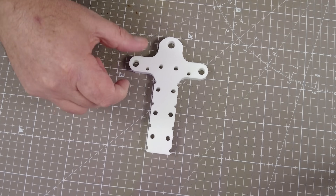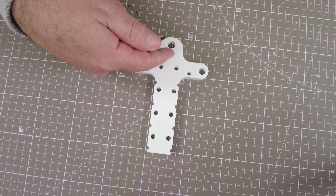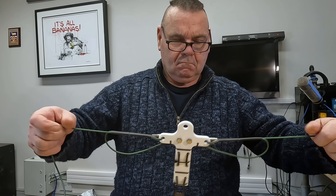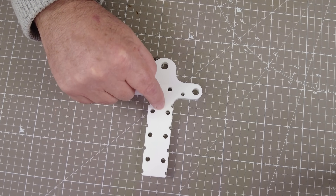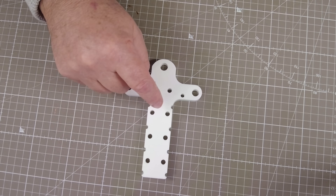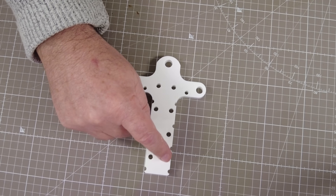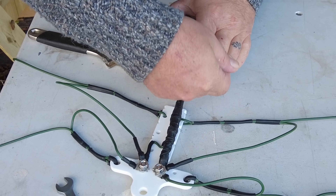It really doesn't matter how you build it — people copy designs — but it actually takes a bit of thought to do something like this. It was like 20 years of experiments to realise we had it wrong. I need a tail down here to stop the feed point breaking, because the amount of times my feed point was breaking was just annoying. So that's for 450 ohm. If you want this as a coax-fed, that's fine — we bring the coax up the middle here, cable tie around these holes, split the coax, put the braid one way and the center the other way. There's also space down here where you could put a choke.